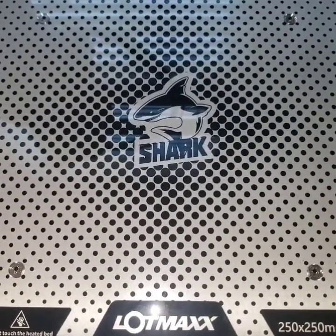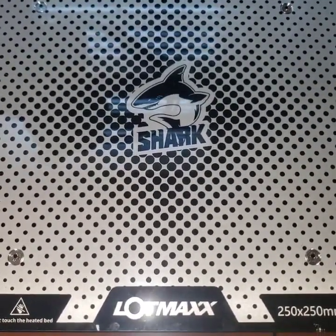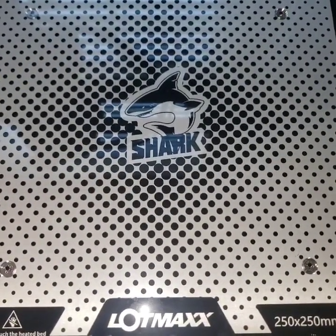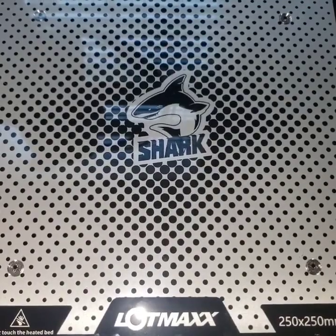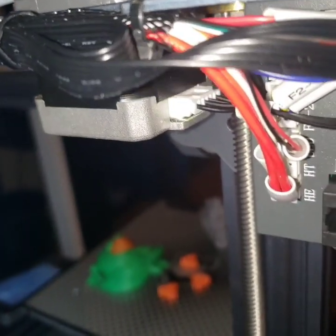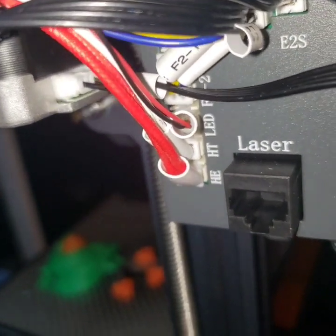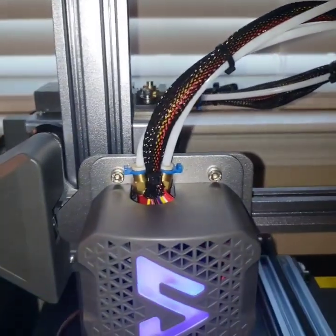One of the things I think lets down the V3 is this glass bed — it's just a plain glass bed with no coating on it, unlike what we get with Creality or other vendors. It would have been nice if they'd added a PEI magnetic removable sheet, or even the BuildTak-style sheet they had on the V2. Another good change is the breakout board, which really helps with cable management and makes the gantry completely removable without wires. They also added some covers to the V-slot wheels — they don't really do anything, just aesthetic. But what about that S light? Who doesn't like that?